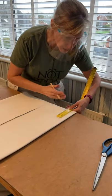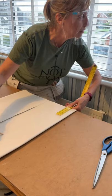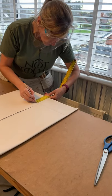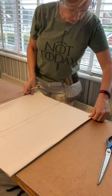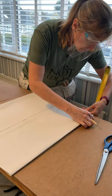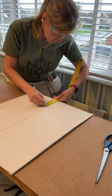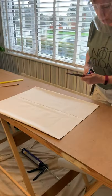The paper must be right at the edge. I've got my 105 there — get my pencil, put my pencil there, and I'm not going to look at my pencil. I'm just going to keep my eye on that mark and make sure it's running parallel with the edge of the paper. It's very tempting to look at it but I don't need to look at it to know it's going to work. Pencil on there, just look at the mark. Now I'm coming up to the pasty bit so I'll just jump over that. That's one piece for the top of the door frame — I'm going to do the same with the other side, not looking at the pencil line at all, just making sure I'm looking at that mark. So now I'm just going to cut those two pieces off.